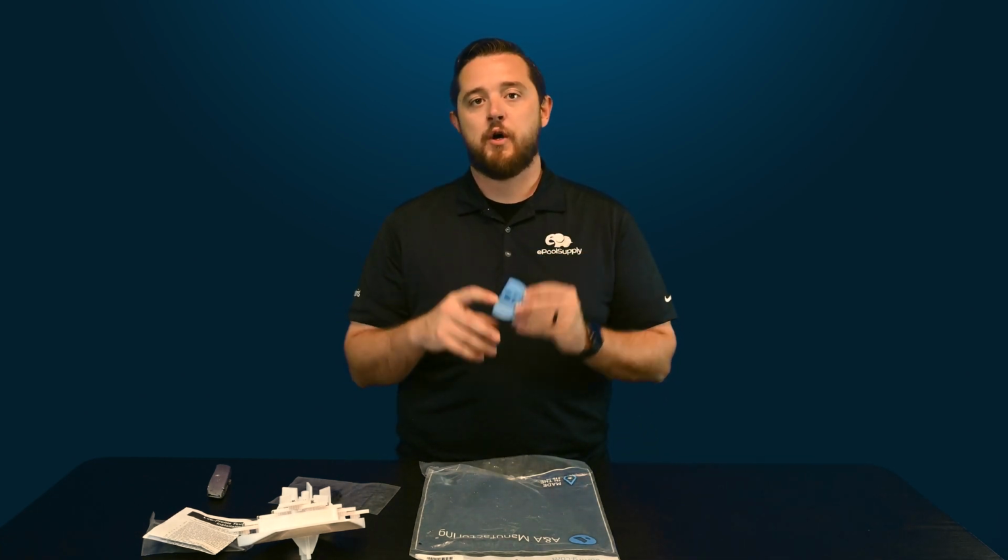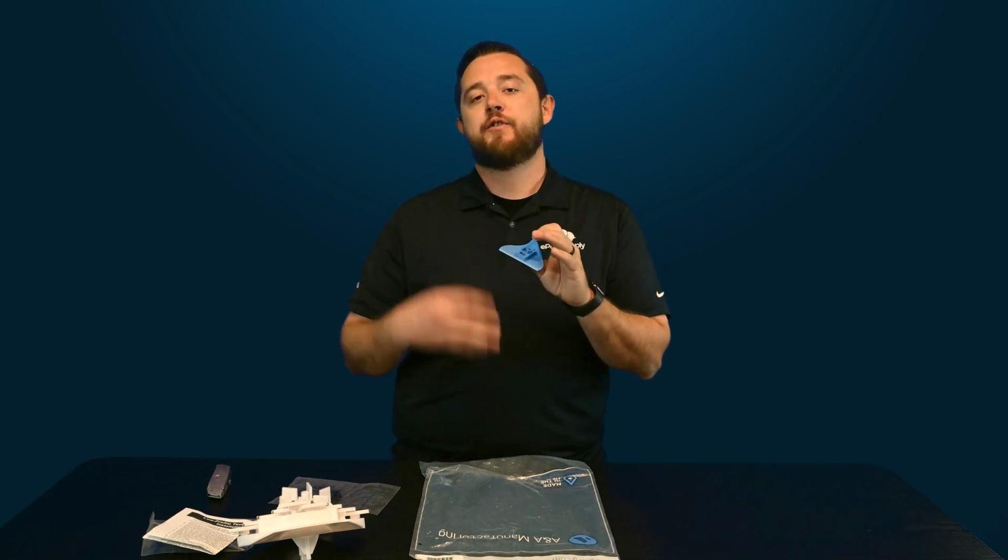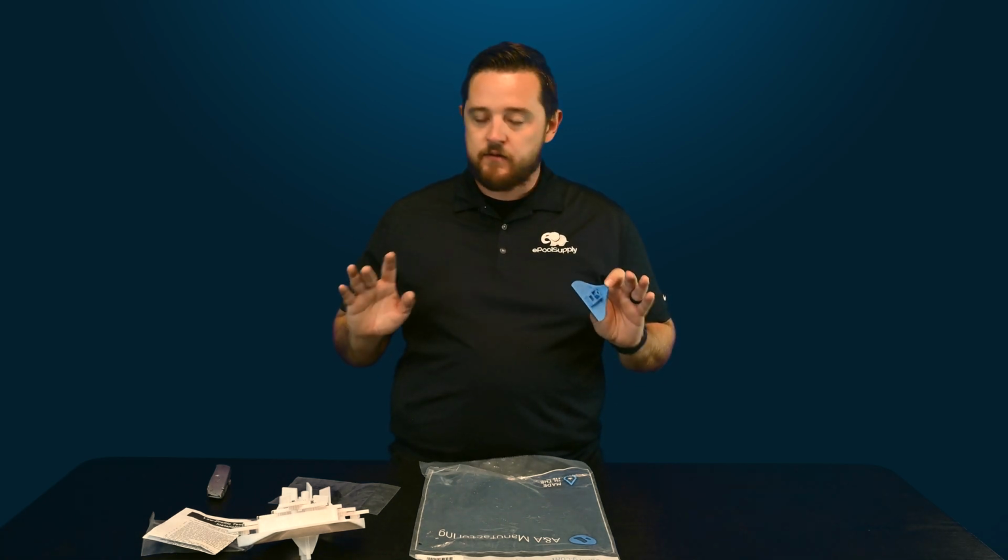And now to the part that makes it unique to a 2-inch 6-port low profile. They have color coded their cams. So for a 2-inch 6-port low profile, you will always be receiving a blue cam. If you've recently bought a brand new valve, don't be alarmed. Some of them will have the blue cam in the bottom. If you still have the traditional white cam, it is completely normal production, what they're doing in the transition of this. It's not in all the new valves, but for those of you who are going to start swapping internals, everything is color coded now, which is really nice, so that when you look for the specific gear kit for your valve, you look for the color.